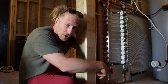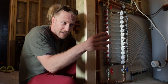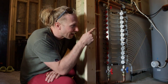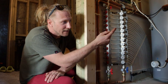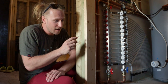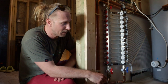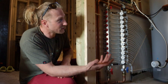I also brought up all the underfloor heating pipes from downstairs, and we've got 24 pipes in total coming into this manifold. Connected to that is the flow and return running back to the air source heat pump — the heat pump puts out hot water into the manifold and it splits off to heat the whole house. Before it does that, there's a T-connection at the back that tees off into the cylinder, so when we want hot water the heat pump sends hot water into the cylinder where a coil inside heats the body of water for showering and such.